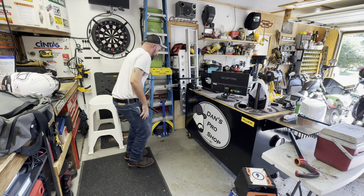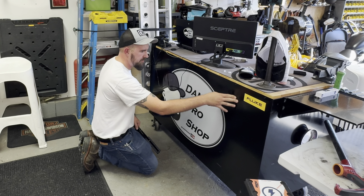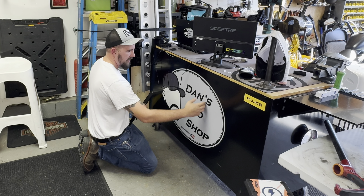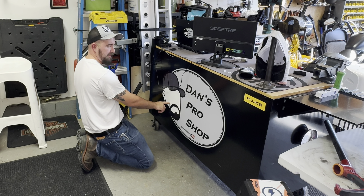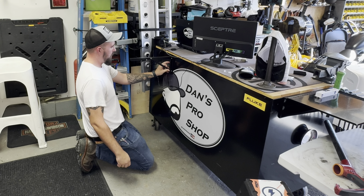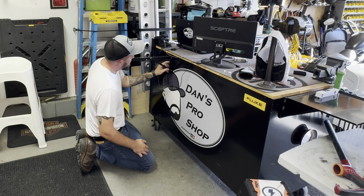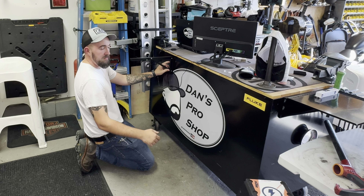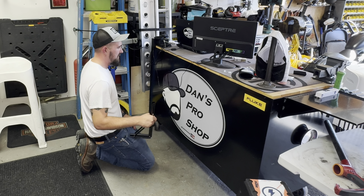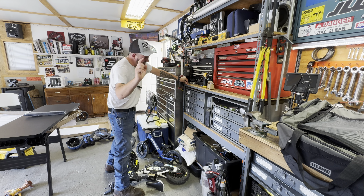Let's take a stab at where I want to put this stuff. I can tell this section is drawers. There's an upright here — you can tell because the rivet's in my face — and then over here is another set. So I think we're going to try to favor putting one bracket here on the ridge, and then the other one we'll just do some measuring and do the same thing. That should right about match up with the top. We'll put the brackets on and then deal with the top once these are on, so we don't have to do all that measuring. I'm thinking some self-tapping zip screws are going to do just fine for this task. Please excuse the bikes everywhere — it's like Jeremy McGrath threw up in here. But hey, bikes are cool, man.